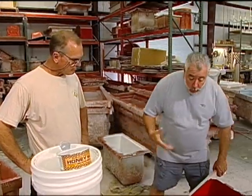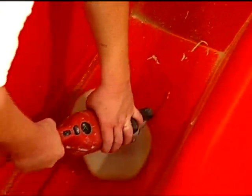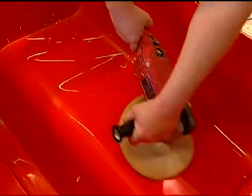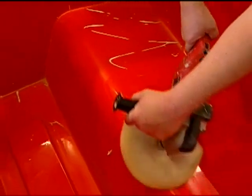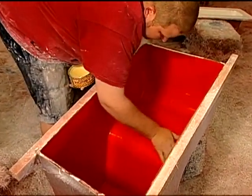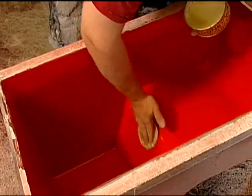Where we left off in the process, Mark, is we were polishing the mold — you said that was really, really important. Where do we begin before we can start putting in gel coat or fiberglass? Just like we did with the plugs, we had to put a layer of wax on there, coat it, let it haze up, take it off, wait an hour — we did that ten times. We use honey wax; that's the releasing agent we use here.